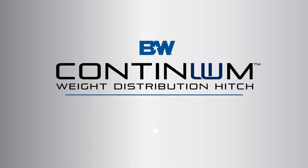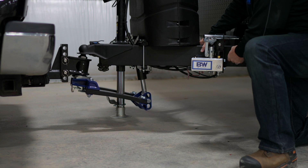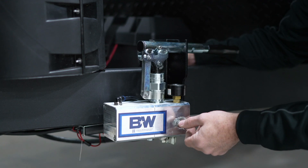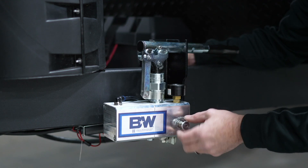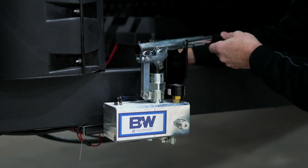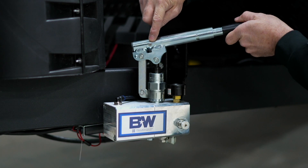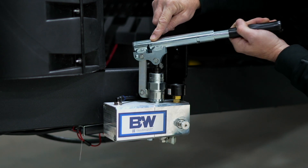Using the hydraulic system to bring pressure to the load bars is very simple. It's done here on one side of the vehicle. You simply close the needle valve here until it's fully shut using only finger pressure. Lift the handle up out of the carrier. There's a little bolt head here that you push forward to slide down in the groove.